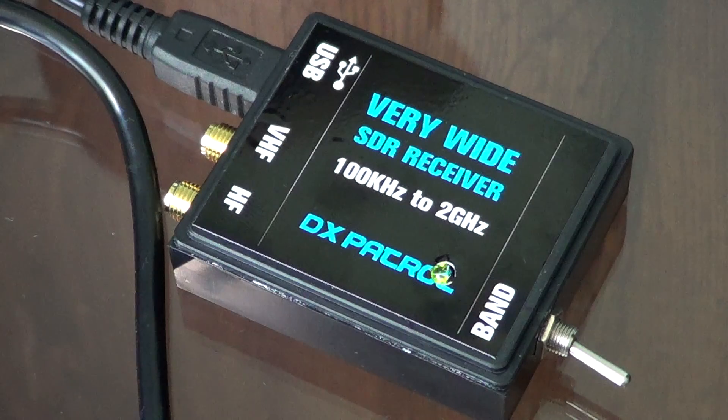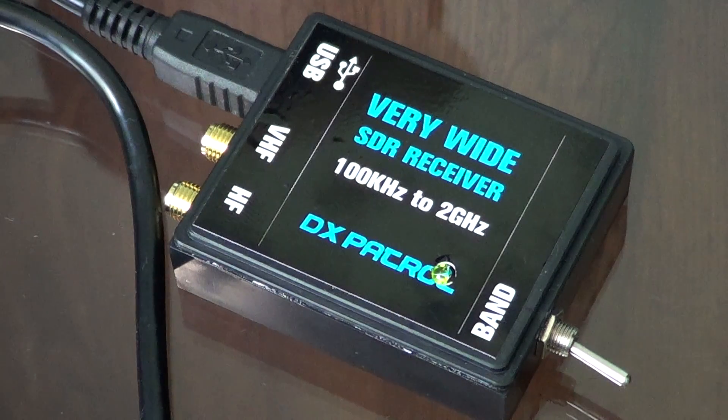I'm surprised. I'm probably doing something wrong. On VHF I tested its sensitivity with a Coast Guard signal on 161.650, which is usually hard to receive. By fiddling with the RF gain I was able to tune it — it seems sensitive. You have to play with the RF gain because putting it to max causes it to drop out. That may be the same issue on HF.